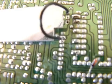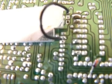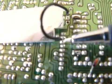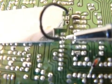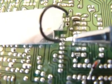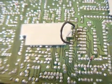It basically comes with just one working band up in 28 megs. So to get the CB band, you take this wire and jump it from that one to this one right here. From here to here and you've got the mod for 11 meters.